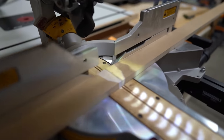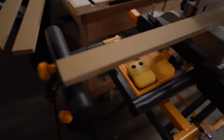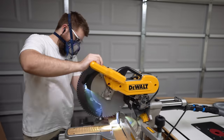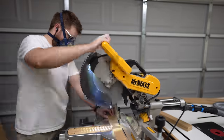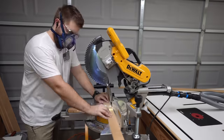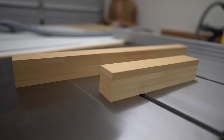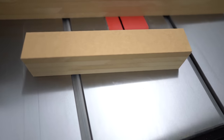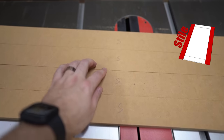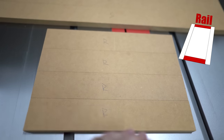I have a simple stop block with my miter saw stand. If you're having trouble figuring out your measurements, I made a measurement video — you don't want to just recreate your old doors at the same size; you may want to change the gaps. The rails were an awkward length for a stop block solution, so I just paid extra attention to accuracy. I'd recommend cutting a couple of extra stiles and rails. Label them so you don't mix them up.